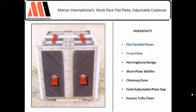This time-honored flat plate design is something we've come full circle on — this was the original design concept. The flat plate design at a 55 degree steep angle is where we are here. If you're at a 55 or 60 degree angle, you have a much better shot of solids falling down and out of the plate pack system.